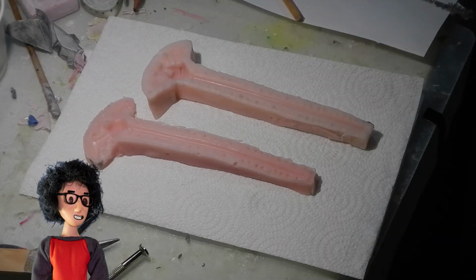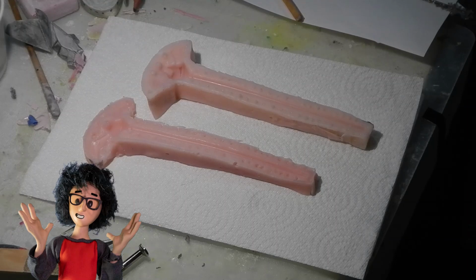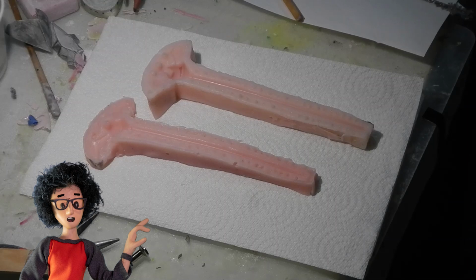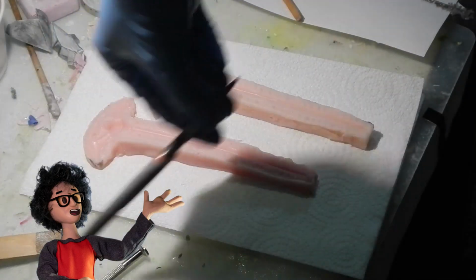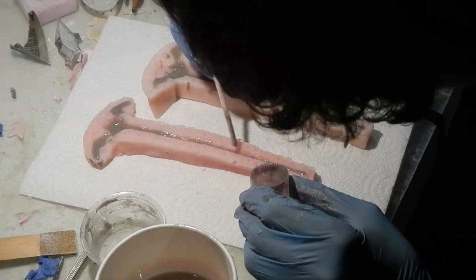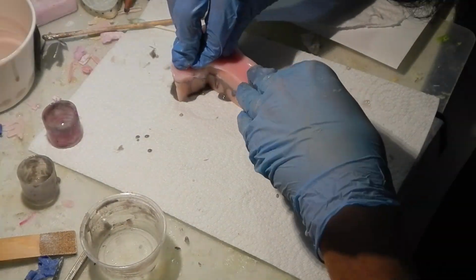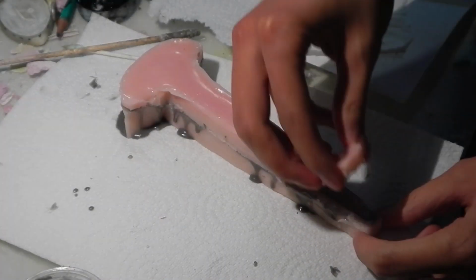When you leave a silicone mold submerged in mineral spirits, it will get bigger. However, the spirits will later evaporate and the mold will shrink back. What we did was let the mold sit in mineral spirits for about 6 hours, and the mold grew into a more reasonable size for the staff. While the mold was still big, I quickly cast many resin copies.